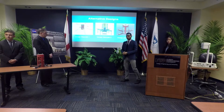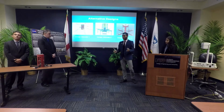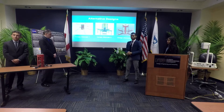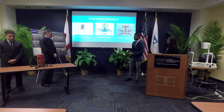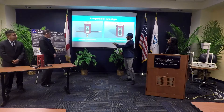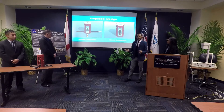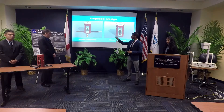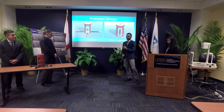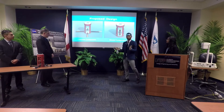We decided to further progress our designs. For our final design, we removed the landing gear completely and lowered the propeller arms down to the base of the body cover to serve as a landing gear. Here is the final design in its extended and stowed configuration. The propeller arms are spring-loaded and connected to a latch system controlled by a servo. Once the quadcopter reaches a certain height, the servo latch rotates and the arms deploy downward.